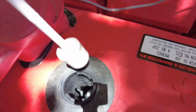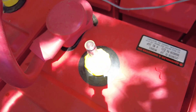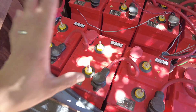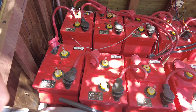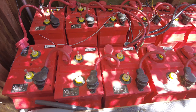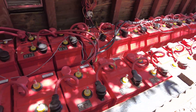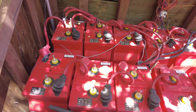You need to monitor the water level at least once a month, especially in the summer when temperatures are warmer and they'll be off-gassing more. That's also the other reason we chose lead acid: we're in a temperate climate, but it can get down to about 35°F and up to about 95°F — these lead acid batteries can live out here in this enclosure absolutely fine, within their temperature profile. Lithium-ion, however, would need to be in a conditioned space, requiring either a separate air-conditioned building or air-conditioning this inverter building.